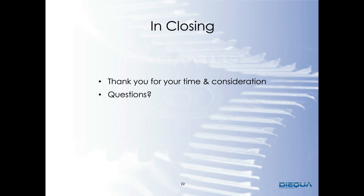That actually brings us to the next question. What is the life expectancy for the worm reducer? Typically, we're looking at 20,000 hours of running life for the reducer. True to any geared product, there is a period of break-in that you'll want to run the reducer through to eliminate any high spots on any of the gear train. Operationally, we're looking at 20,000 hours.